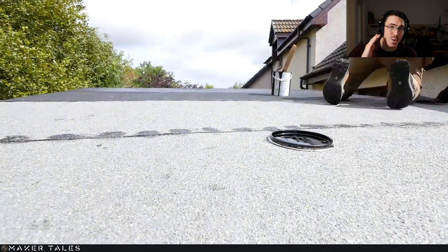Now, this bitumen is quite expensive and smells a lot. Make sure you wear safety glasses, because if you get this in your eye, you're screwed. Thankfully, I had safety glasses and I did have splatters on there. This was also almost a gale force 7 wind when I was doing this, so it's a little bit dangerous. Keep it really well mixed. You can use even a broom to put this on, because it is super thick and you're going to go through it so quickly on the first layer. It's incredible how much it soaks in.